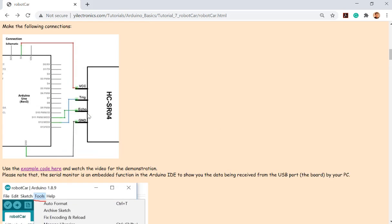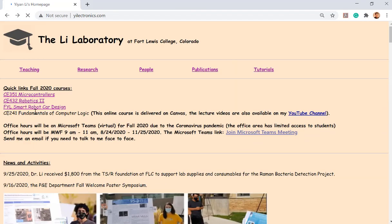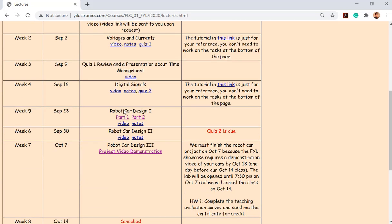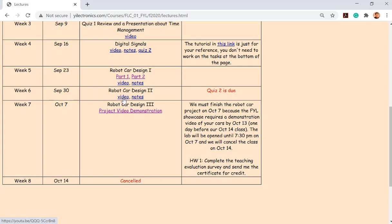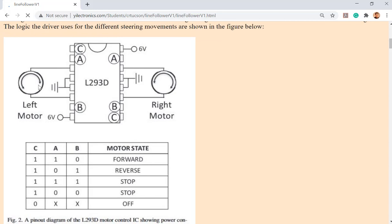The way the line tracker works involves two things you need to know. DC motors are low-resistance devices — low resistance means it's a heavy load. If you apply the same voltage, it's only around 50 ohms, so 5 volts divided by 50 ohms is like 100 milliamps. That's why you need a driver between the power source and the DC motor — you don't want to directly drive it using a DC voltage.